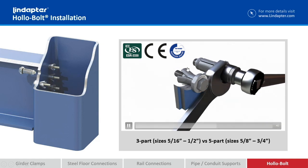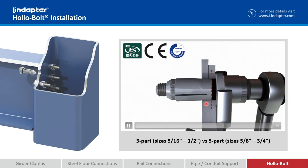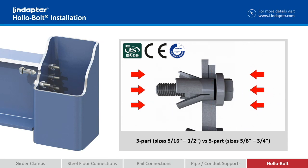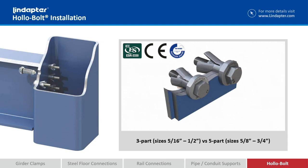When we start getting to the larger ones, look at this red dashed line and see what happens as we're tightening it: the rubber washer collapses and we draw the sleeve, which restrains the base material on one side, and the collar on the fixture side, bringing them closer together. The whole point is that when we get up to these large hollow bolts, the sleeve steel starts getting thicker and we don't get a perfect crease right there directly behind the base material.